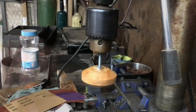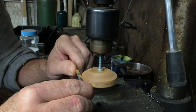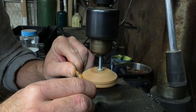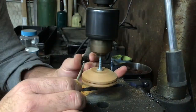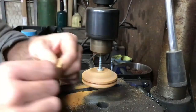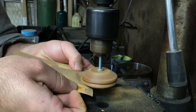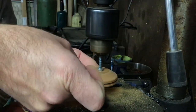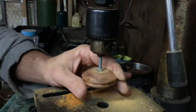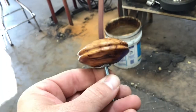For the fuller, I'm going to go over to the drill press and use a file. First, I'm going to scribe a line to get me started and make sure it's right in the middle. I'm doing this with a triangle file, and then next I'm going to move to a round file and make that fuller rounded. I'll move on from here just like I did with the pommel and work my way up through the grit, starting with about 100 grit. I've also got to take the round file and run sandpaper through the middle. Once you get finished, it gives you a nice, smooth finish.